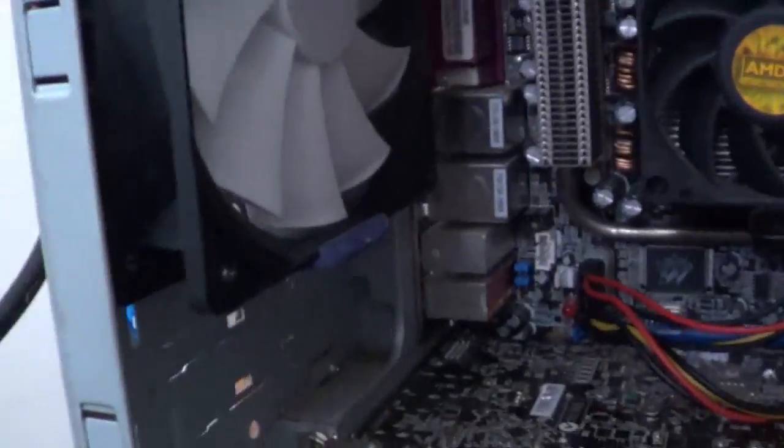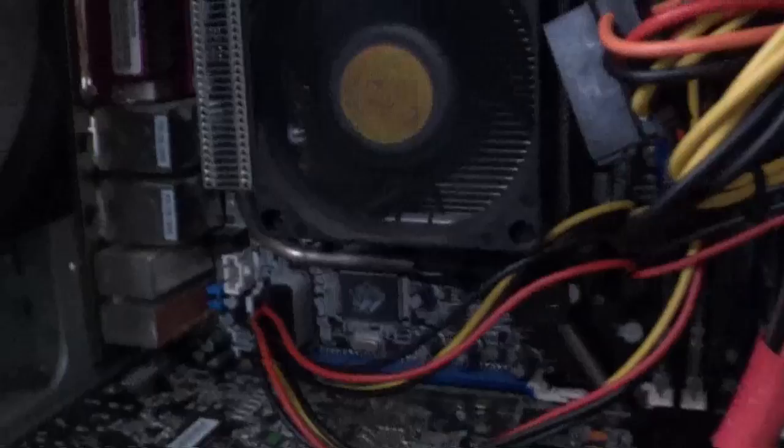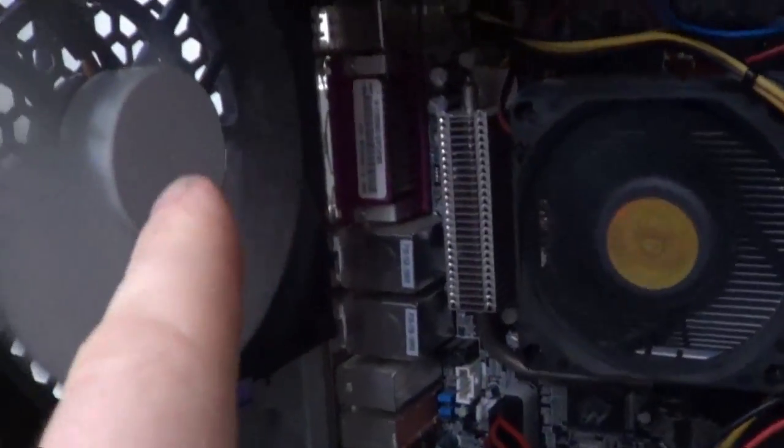Goofy fan holders aside, though, this thing definitely was ahead of its time in some areas. It has some pretty serious server potential as well, although it is very much an early 2000s ATX case, where the power supply is trying to suck heat off the top of the processor. So, there we go. Now it's running at BIOS level speeds. This is the inherent problem I have with these sorts of things, is they seem to impede the airflow a little. So I upgraded it to some of the old Fractal 120s I had sitting around. We use Cooler Masters for any remaining 120s on here.